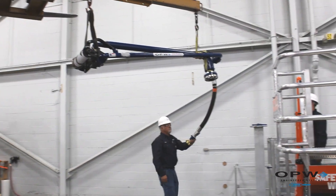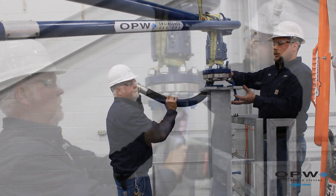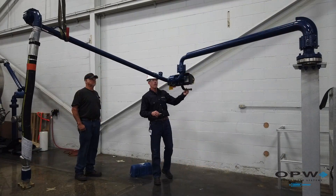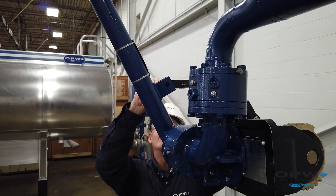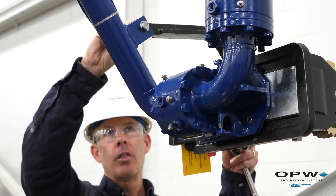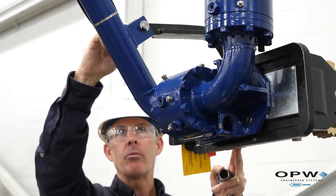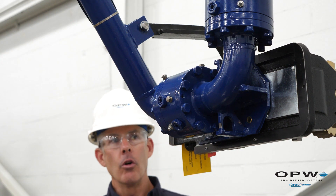Let's begin the lift. Once the arm is lifted, you get your spring pin, put that through, get your lever arm plugged in, get everything lined up, and insert the pin. It's secured on both sides with E-clips. Once that is secured, you can lower the arm and we'll go through the spring adjustment.